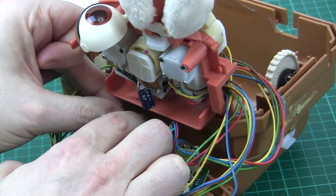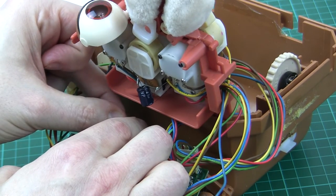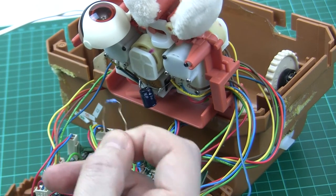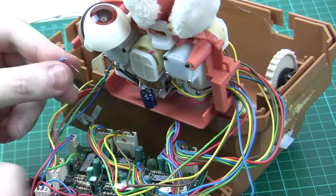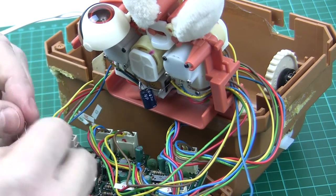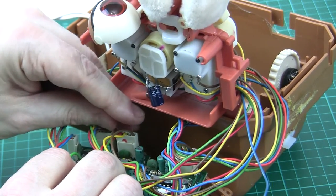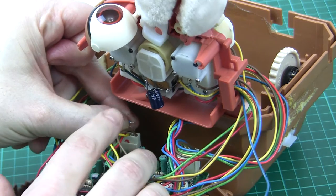As I remove it, it drives back. My fix is that I've introduced a quite weak resistor — the sense for the position is a 4.7 kilohm resistor, so 39 kilohm is very small in respect to that. Even with the resistor in place we're not going to damage anything or try to drive the thing to a position it wouldn't naturally go to. It's a very small influence when the signal is actually there, but when the signal is out, it has a large enough influence to hopefully move the servo and clear any dirt or debris on that carbon track.